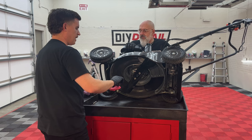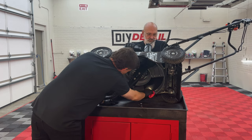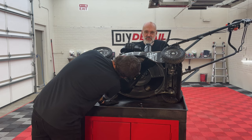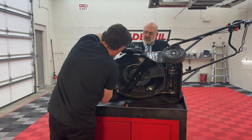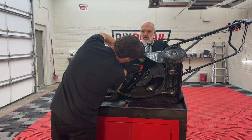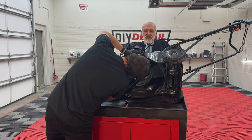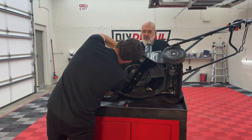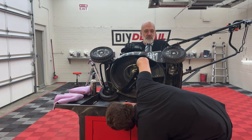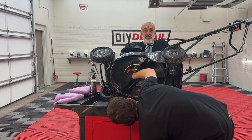Ivan's instructions: coat everything. If you can see it, you can coat it. We're not worried about high spots under here — we're actually going to leave the coating there, just slather it in. We also have another great product for the underside: quick beads. After pressure washing the underside of your mower deck, add quick beads and the next cleaning will be so much easier. The blade and inside of the deck will get heavy abrasion over the years and wear the coating off, but having it there slows that process down. Use quick beads as a follow-up and your mower deck will last a lot longer and be much easier to clean.